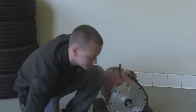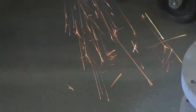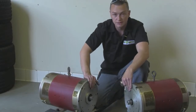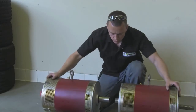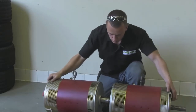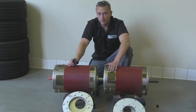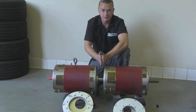Now our mark is set — let's go ahead and cut it off. So we have our two motor shafts cut down. Let's put the coupler in between the two, push them together, and make sure our distance is a little less than three inches — maybe 20 thousandths under. I checked the distances between the two and we're just under three inches, so we're good to go. I'll pull the motors back apart, put this flange on this motor and this one on the other. You bolt the flanges to the motor first and then you bolt the two flanges together.